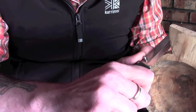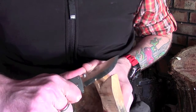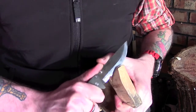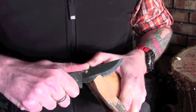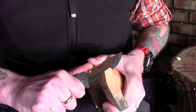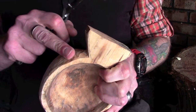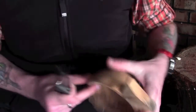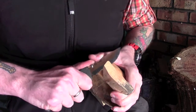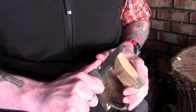And this part is particularly easy. Really all you need to do is take your knife and just start rounding down up to the point where your handle meets the bowl. This is a really easy, simple process — takes all of a couple of minutes. All you're trying to do is just extend the curve of the bowl down into your handle. It won't be perfect because we've got a little bit of sanding to do after this as well, but because you've already got that line in there, you know where you're following — you just keep to that line.